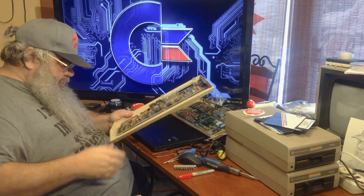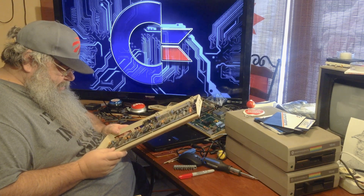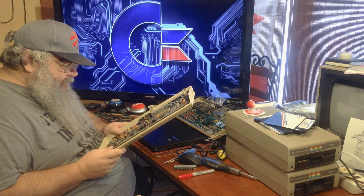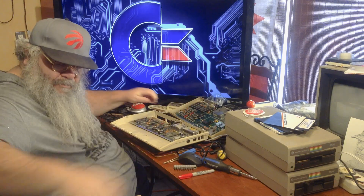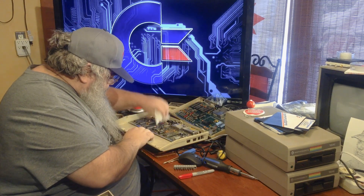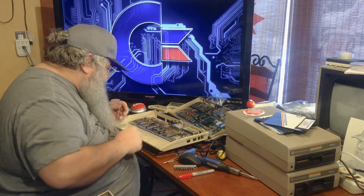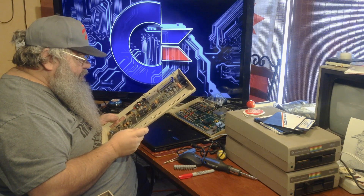This is definitely modern - modern things have been combined. There's this big pin chip 251715 - that's the one for that. Here's an 8500. I wonder if that will go the same as the 6510. The video chips seem to look to be the same. Basically this machine would have been made in the era when the 128 was out, because they renamed some chips to 85xx series.